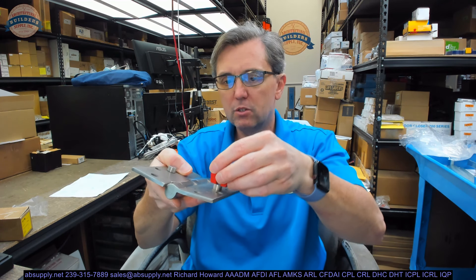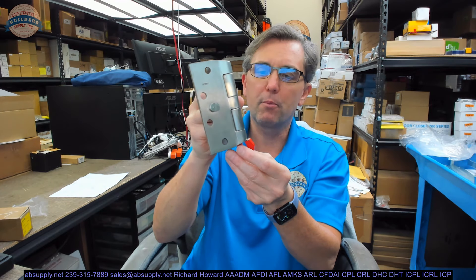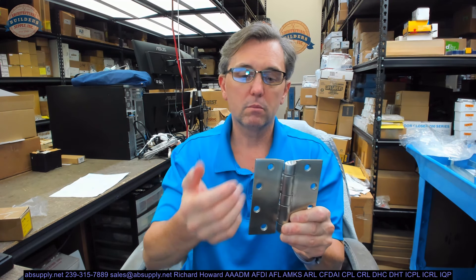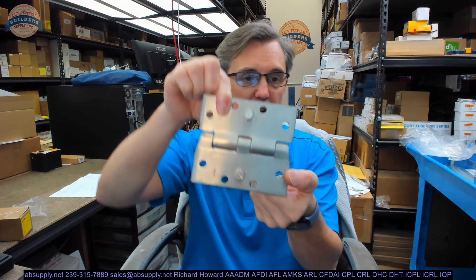This is solid stainless steel. It is not unusual for stainless to be marginally magnetic when it has been machined or worked. Type 304 picks up some magnetic property; 316 doesn't to any perceptible level. So — 5 inch tall, heavyweight, solid stainless. That tells me, before we even get into the unusual treatment to the hinge knuckle and the pair of pieces on the back, that you have a very heavy door, a high volume door, an exterior door — something used a lot, maybe wider than 3 foot 6, which is where the 5 inch comes in.